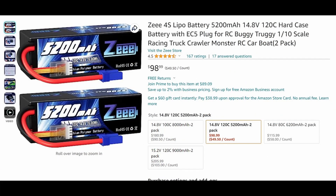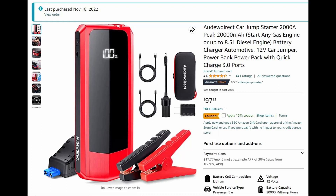Whether you decide to buy a 4S battery and make your own jump start, repair one, or buy a dedicated unit, I just think it's a much better idea than trying to use a 21-volt system on your car. Not only can it mess up the actual high-dollar batteries by putting that much load across them, but with the alternator putting back voltage across it, I think it can do even more irreversible damage to the car's alternator and electronic systems.